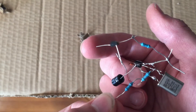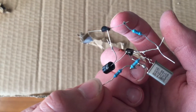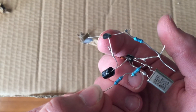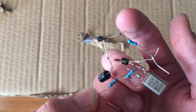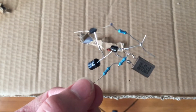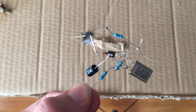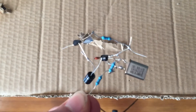This right here is your audio input and you can put in a headphone level signal, just turn your volume up. And then right here between the output and the resistor is where you would have your RF out, which if you wanted to hook it into an antenna or an amplifier — but we usually just run it as is and it radiates RF.